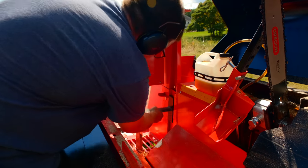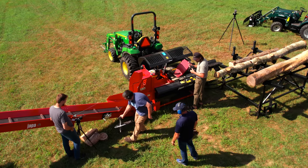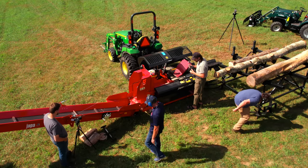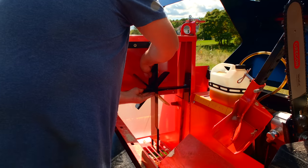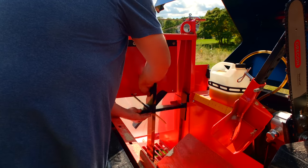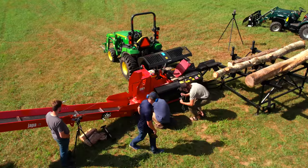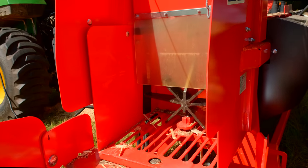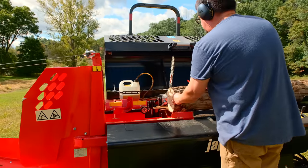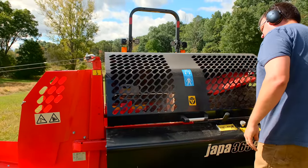Then we open the hood, and we flip up the saw arm so it's out of the way, and then we lift the current knife out. You can see it's a cassette style knife, so you kind of have to get it up and then go diagonal out, and then drop the new knife in, put the pins back in, drop your log stopper arm back in place, and then I just do a test run. Move the knife up and down a couple times to make sure that we are engaged and everything is moving freely, and then we're able to start cutting with the new knife change.